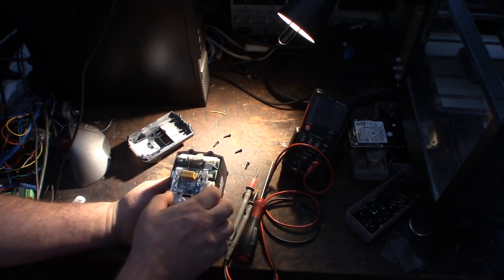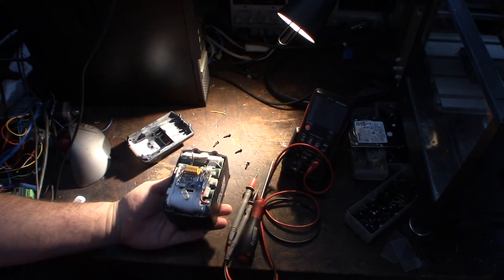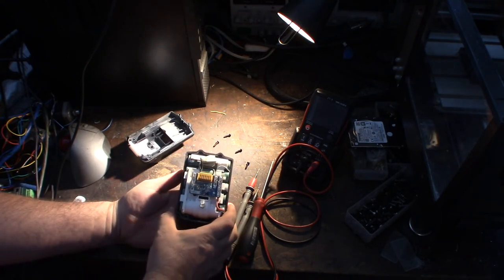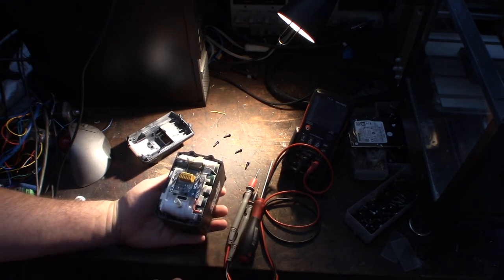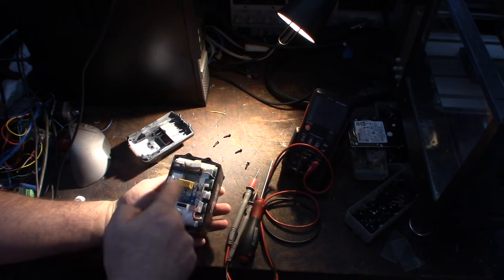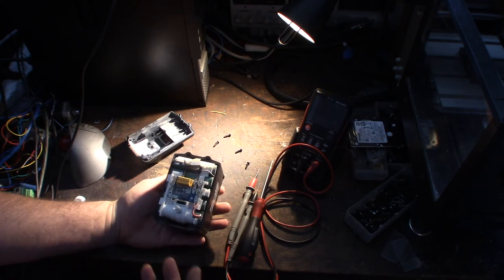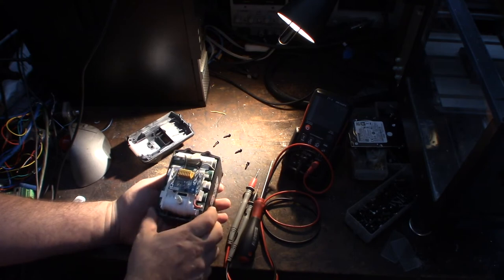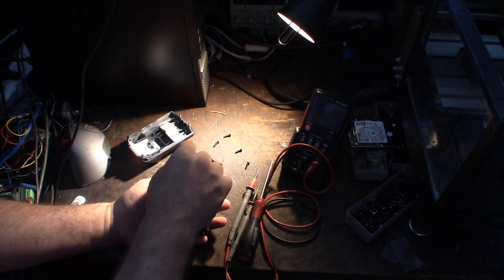The cool thing about these aftermarket batteries is they got rid of that flash. It's a little dangerous because you can charge a battery with a bad cell and possibly burn a cell out. But it's a battery management board, just not the same thing. It won't reject the battery, typically. I've actually made several videos on these bootleg boards you can buy on Amazon. If you have an old Makita battery that's been rejected from the charger, you can replace it with the bootleg board.